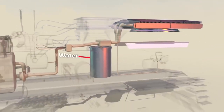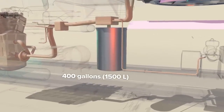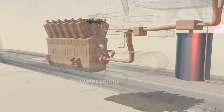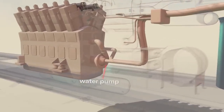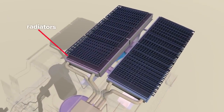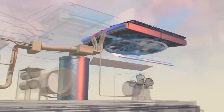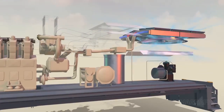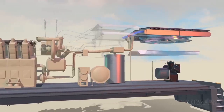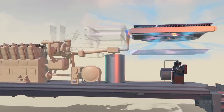To save costs and avoid potentially hazardous antifreeze leaks, water is used for various cooling duties. A large tank holds nearly 400 gallons of water, and an engine-driven water pump supplies pressure to the system. There are large banks of radiators with external shutters to help manage airflow. An oversized fan pulls outside air past these radiators as water courses through internal tubes. This cooling water flows to the engine, EGR cooler, turbochargers, air compressor, and more. During cold weather, it also runs through the fuel system pre-heater to warm the fuel before combustion.